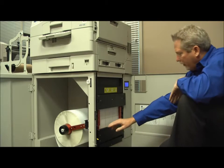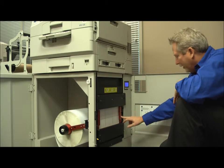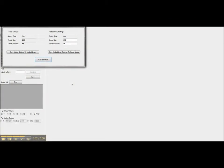We're going to back off the gap. We can see it's just below our sensor, which is the square opening on the right-hand side red guide. We're going to run another little sensor calibration through the software, so I'm back at the software and I'm going to run that calibration test again — hit Run Calibration. My window disappears, which means the calibration ran perfectly.